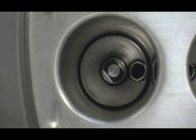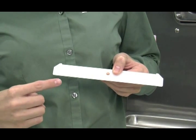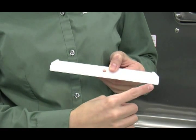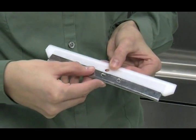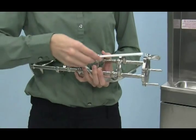Be sure the drive shaft fits into the drive coupling without binding. Check the scraper blades for any nicks or signs of wear. If any nicks are present, replace both blades. If the blades are in good condition, install the scraper blade clips on the scraper blades.